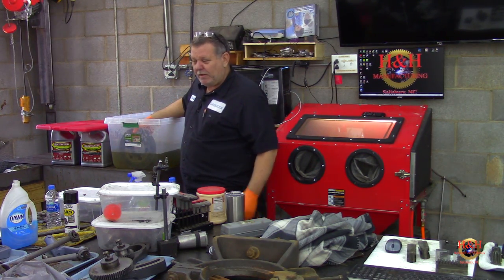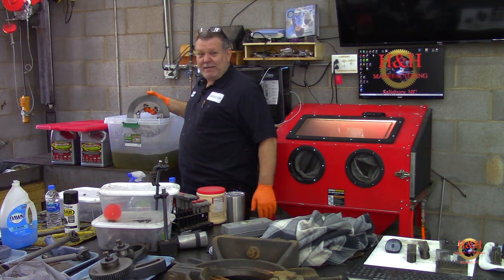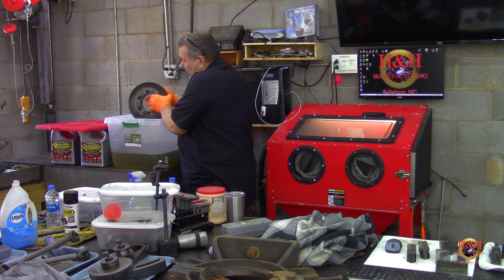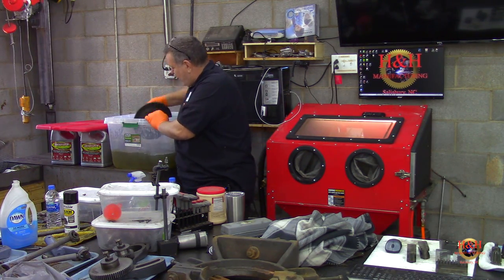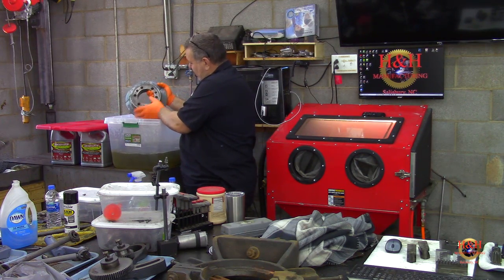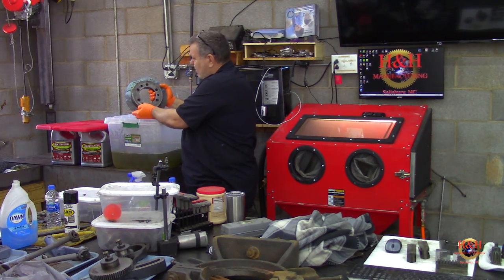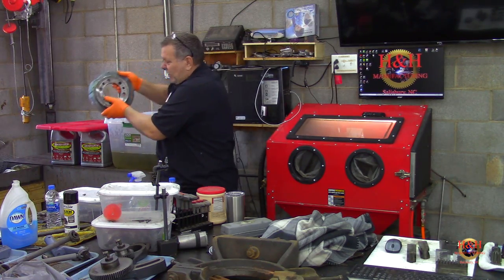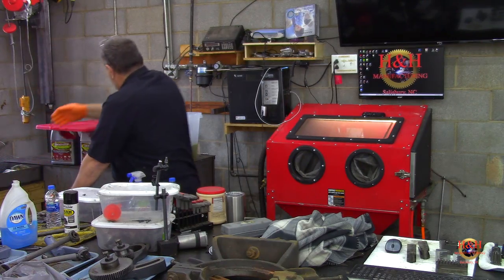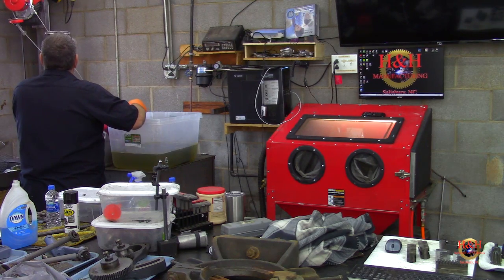This is the part that didn't have any water on it and you can tell — that thing looks brand new. But flip it over and you can see it has some surface pitting. Not bad though — I think we'll easily be able to get all that out. Looking at the back side, it turned out great. I tried to zoom in so you can see it. It did an immaculate job. I'm going to lay it over here in the rinse-off tank, then get the crane to get the main chuck body out because it is super duper heavy.